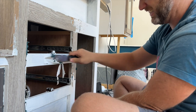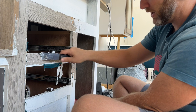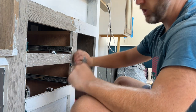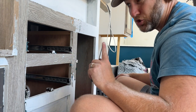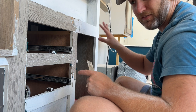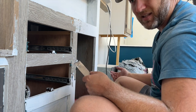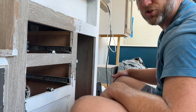Just look at that — you would practically never know we had even painted here. So if you're watching this and want to learn one thing: don't do what we did. You've got to scuff up the surfaces. You need a bonding primer. Otherwise you're going to waste a lot of time, because the paint is just going to chip right off, especially in the heat.